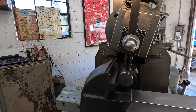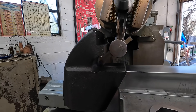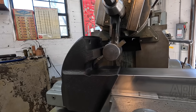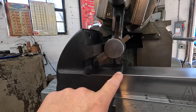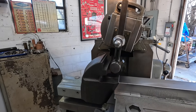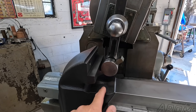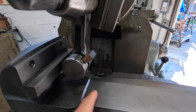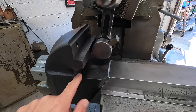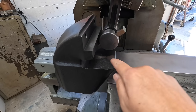I wanted to point out this is just one of the benefits of being able to use a shaper — you can kind of easily get up into sections like that. You can see I've got my tool in there, set at a 45-degree angle, and I can easily use this to get in here and cut this little pad. You could set this up in a milling machine and come through with a face mill, but you'd need a long gauge tool to reach down here, and you'd also be touching this other surface. I'd like to stay off of that and machine just this area right here, so when our line starts for our linear pattern we'll just be right there at that existing line.